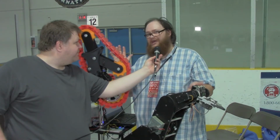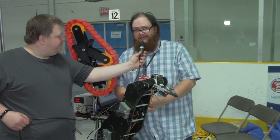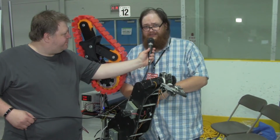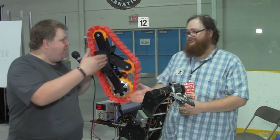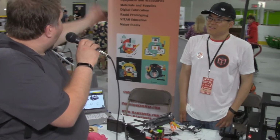This wheelchair motor moves the whole assembly this way and that way, away from my face, preferably. And it has this bicycle shock in here, which allows it to push. If somebody were to have a lot of weight, it would support them fairly well. It's meant to be not just an all-terrain vehicle, but to be able to climb up stairs eventually, because a lot of places aren't made accessible for people. Just painting a door blue doesn't make it a wheelchair bathroom door. Just saying. Oh, I understand that completely.